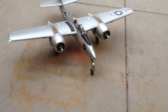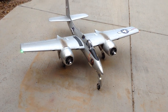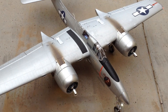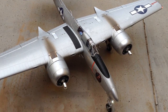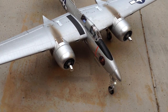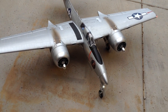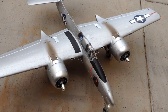I have a Zippy 8030C battery in this thing. At max, this thing pulls 109 amps on static — it unloads in the air, just like you saw in Rich's video, to much less than that. At idle, telemetry is reporting back like 15 amps combined between both motors, and I am running a separate ESC setup inside.